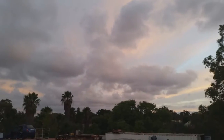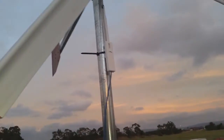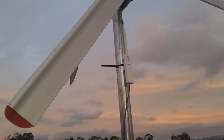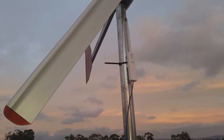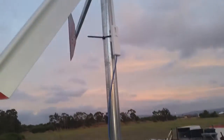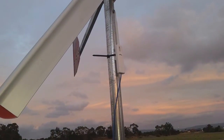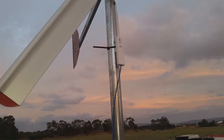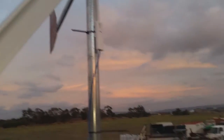I'll stop this video here, then hook it up to power — it's already configured — and plug it into the router inside to see how it goes. I'm hoping to get Wi-Fi inside the workshop. They say it's got a 500-meter outdoor range, though that'll be dependent on the signal getting back from the device. They also say it's got a one-kilometer range in AirMax mode — point-to-point with another device. So we'll see. Just a pretty ghetto bodge-up and see how it goes.